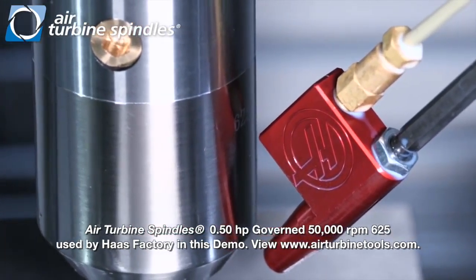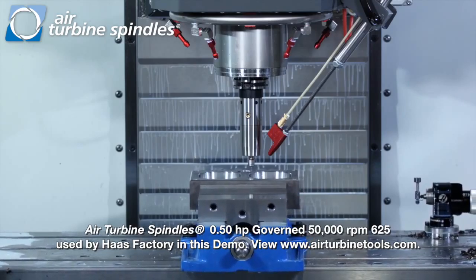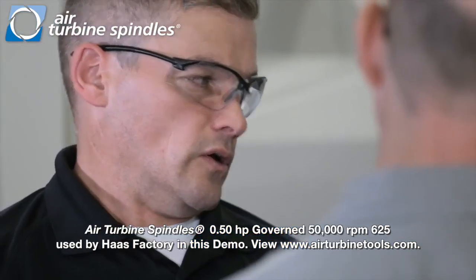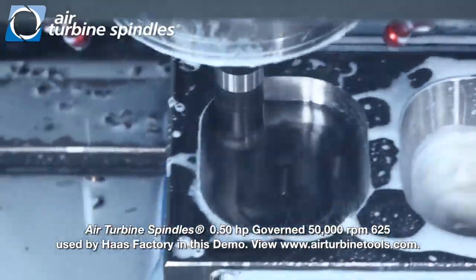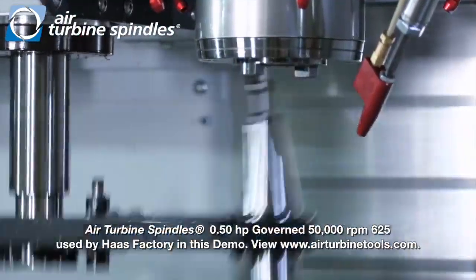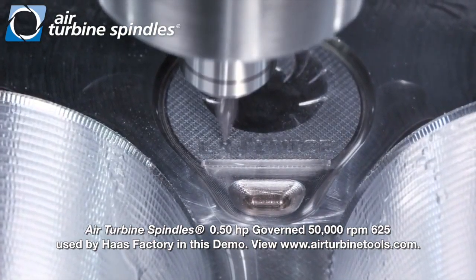You've also got the MQL option installed in this machine lubricating those tools — it's a good match. It keeps our tools nice and sharp. So that makes TAB even more useful. I can start out with my roughing and keep the chips out of the cut, and I can finish up with very fine machining and drilling — all with the TAB option.